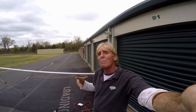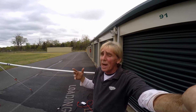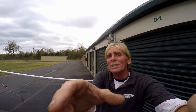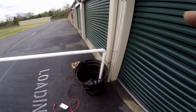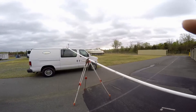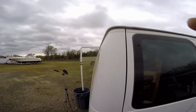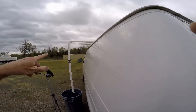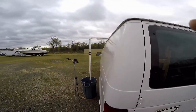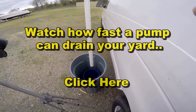We use pumps in the backyard — we call them backyard sump pumps — because you've got that low spot in your backyard that's uphill to the street. My suggestion a lot of times is to put a sump pump in; it's actually a lift station where water is lifted up and carried out. You can see our pump in the pit, rising three feet to this point, and I've created an uphill run to the curb by bringing that pipe up and over the van. Not only are we lifting it about eight feet total, we're also pushing it 30 feet before it gets to the discharge point. We're going to plug in the pump and see how long it takes to fill up a five-gallon bucket.